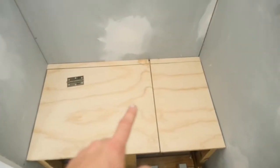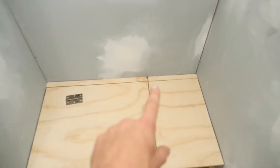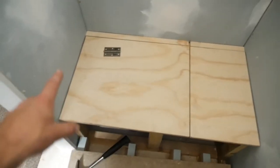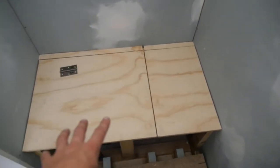That's how it's going to sit — you can see the grain lines up nice and neat. I'm going to put hinges up here: one hinge there, one there, and then two in there. These front sections fold up. So now I'm going to bevel the edge — 45 degrees with the router on all edges — that will neaten it up a little bit.